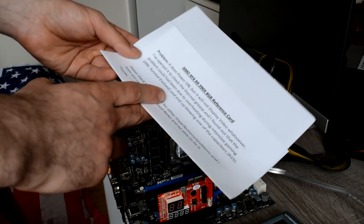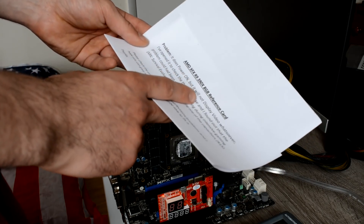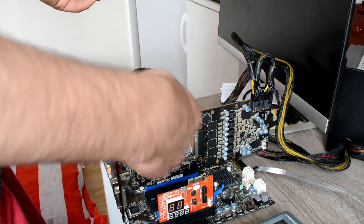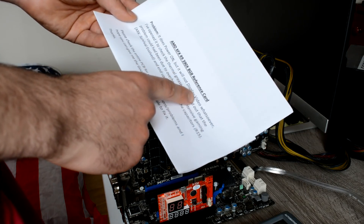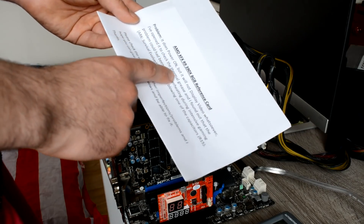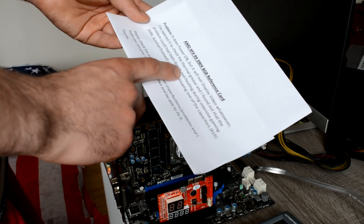He provided a letter as well. It does power on — I took the cooling system out but the fan spins up. So that's probably what he means by 'power is on.' But it will not display video whatsoever. I've opened it to check the thermal paste and found the problem could have been due to overheat.